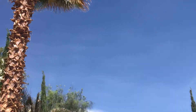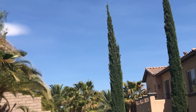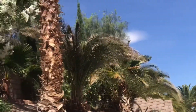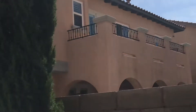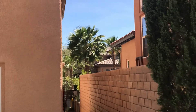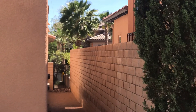The other problem is that all these houses here have intercoms in them. And when I fire up on 80 meters or 40 meters, I come through on all the intercoms, especially on AM. So I can only really transmit on 20 meters, 15, and 10, because I will blow the neighbors out and my own house from RFI on lower frequencies. This thing is so close to my ham shack that it gets RF into my transmitter and makes the mic hot sometimes.